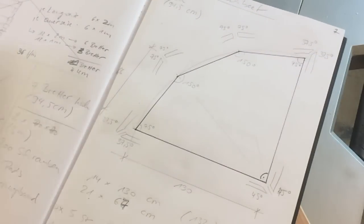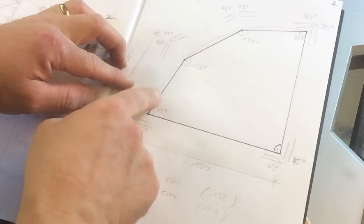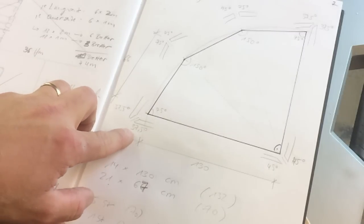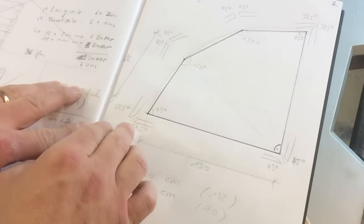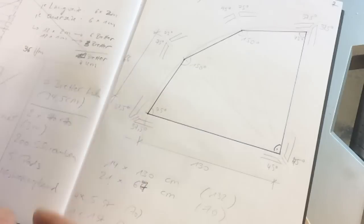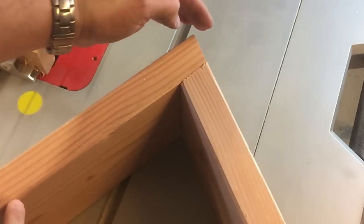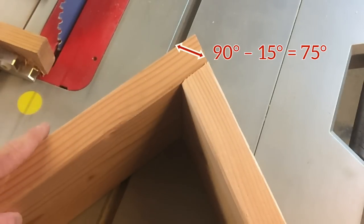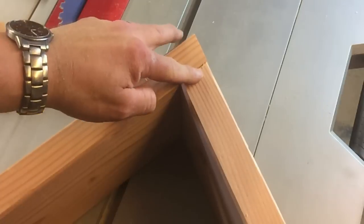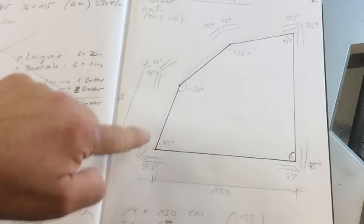I had to change my plans here a little. At first I wanted to make this corner as a miter with some half angles for each of these two boards, and that angle would have been 37.5 degrees on each board. But I don't have a way to cut such a small angle — I can't go below 45 degrees. So I have to change that into a different sort of miter: one board with a 15 degree angle, which makes it 75 degrees altogether, and this board too will have those 75 degrees. They're not going to be a miter but just put together, and now I have this 75 degree corner which works well.